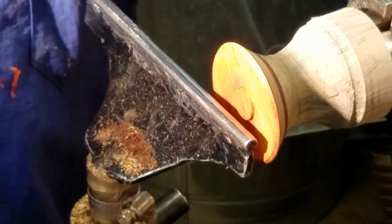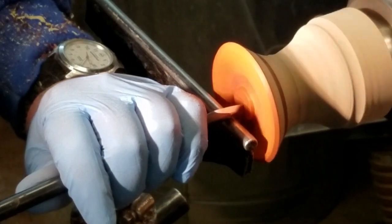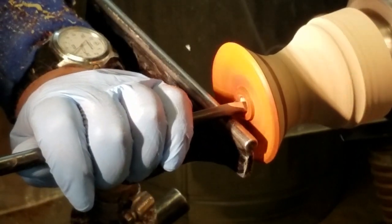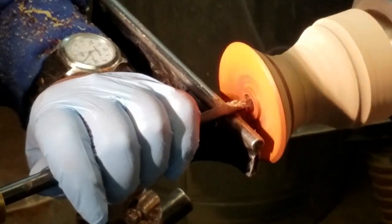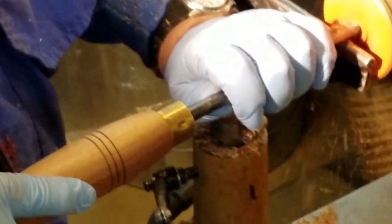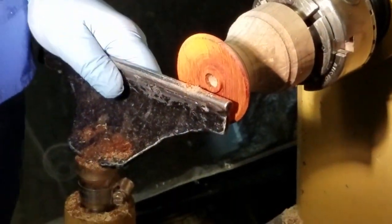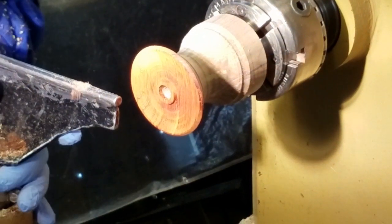If you take a spindle gouge and turn it up on its side, you can actually use it like a drill. And I can drill that out. Makes a nice hole to remove some of the wood, because I'm going to cut it down more on the outside, and then when I shape it, we're going to then go ahead to sand it.